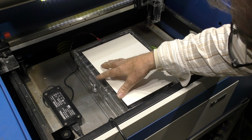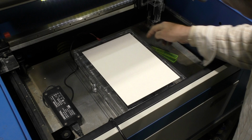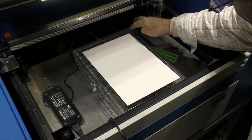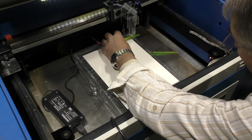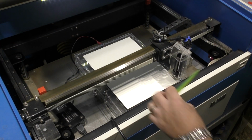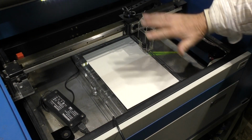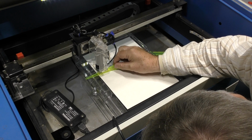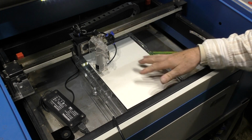When I've manufactured this bed, I've put a 3-point location system on it. So I can jack these 2 points up to get them level front and back. And then I can start from this as well, let's just do it, 10.5mm. We can come forward to the front, and I can set that up to 10.5mm as well. So back to front is spot on. And now across the side here, 10.5mm. Now it's an absolutely perfectly flat plane on which I'm going to engrave.